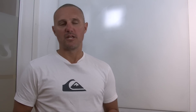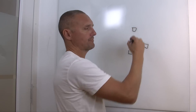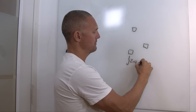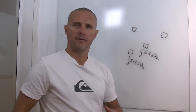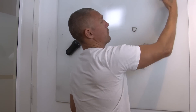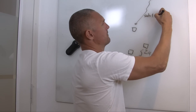One more example is remote beacon management. Assume you have a shop or a museum where you have a lot of nodes sending out beacons — sending out information about prices or about the exhibits — so, 2.4 GHz beacons. In order to update these beacons, you can use the dual-band capability of the CC1350. You will have one end node which updates each and every node using the sub-1 GHz link.